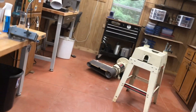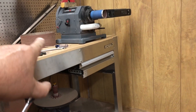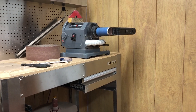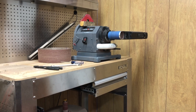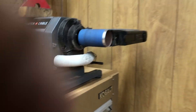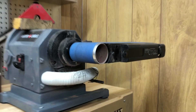I've ordered some six-by-48 ceramic belts. On my four-by-36 I put ceramic belts when sanding steel because oxide belts wear down almost immediately — and those ceramic belts are about $14 each, and I bought ten. The six-by-48 belts are two inches wider and a whole foot longer for $10 each, and I bought about ten of those. They last a long time, and when they start to wear out you take the edge of a sharp piece of steel and run it across — it fractures the ceramic and feels like a brand new belt.